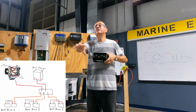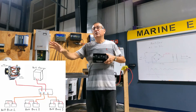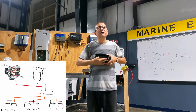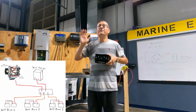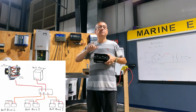I have a battery bank of 600, divided into three battery banks: 200, 200, and 200 — one output, two outputs, three outputs. The battery charger provides 80 amps here. The minimum should be 60, but it supplies 80. That's perfect.